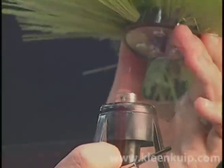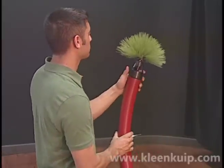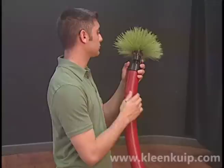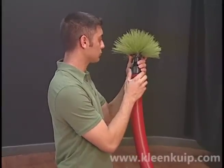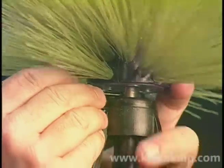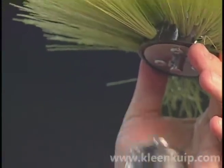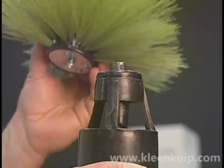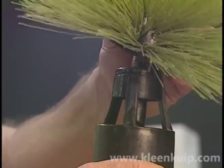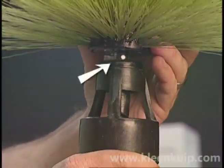Here's how to change the brush. Walk around the hose to the button at the base of the brush. Avoid rotating the brush to access the brush button because the added torque will make the brush button more difficult to depress. Press the button with a ballpoint pen or a small screwdriver and take off the brush. To attach a brush, position the brush hub at an angle to the nozzle assembly. Depress the brush button and slide the brush down until the button snaps flush with the cable.